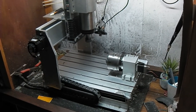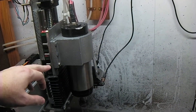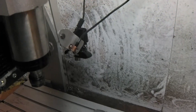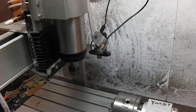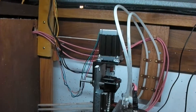Finally got the machine together again with the new taller side panels on. The Z has retracted quite far — one side effect is this spindle mounting plate, the aluminium bracket, could have been a bit lower down, so the motor itself is now substantially lower in that bracket than before. Reattached the endoscopic camera, and behind it is a new fixed webcam — a sub-$10 Aldi camera that can do motion JPEG 720 streaming with hardware-encoded JPEGs, taking very little CPU on the Raspberry Pi. Up top is the Pi camera giving an overview of the whole enclosure. The assembly with power lines and water is now higher up with new cable clamps at the back.